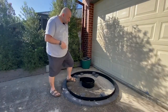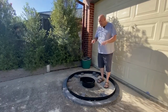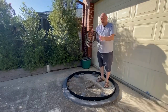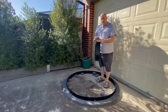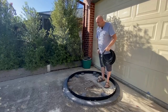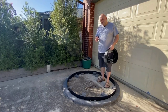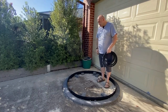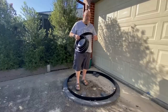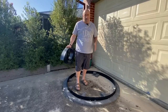Alright guys, here we are again, back with the next step. So we've got the circle — beautiful, it's come up really nice. Cut with just that single one angle. Now we have to transfer this circle across to the weeping cherry, and that's a challenge. What I've come up with is we need just this ordinary plastic garden edging — this is actually 150 mil. You can buy it in rolls of about 10 meters, pretty cheap and inexpensive. What we're going to do with this roll is actually form the inner circle, because we need to basically transfer this circle over there. As you start laying the bricks, it could potentially get out of whack, so you need a guide. I've laid this out on the internal and joined it together with some tape — gaffer tape — and then some cable ties. Ultimately this is just to transfer the circle across.